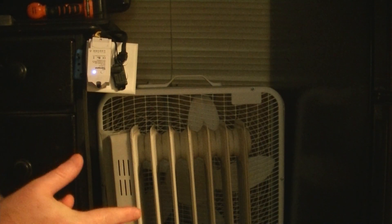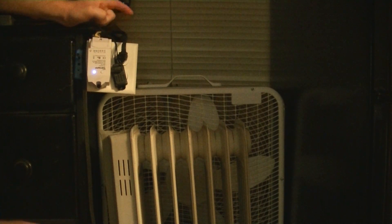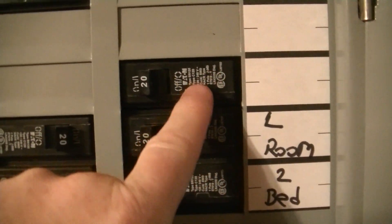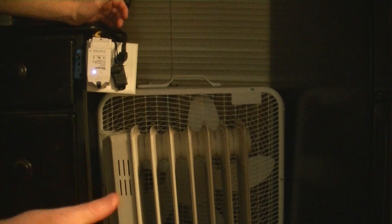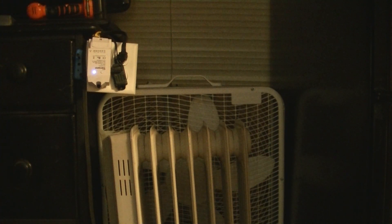The way this setup works is this receptacle you're looking at is a single receptacle — it's a two-gang box but a single receptacle, 20-amp, with a piece of 12-2 dedicated wire that runs back to the breaker panel. In that breaker panel I have a dedicated 20-amp breaker, so this is 20 amps just for this. That's in my solar breaker panel, but if the solar doesn't have the power to run it, it switches over to the grid, and the grid can run it.